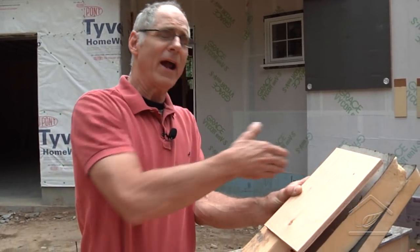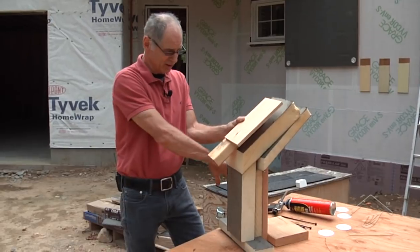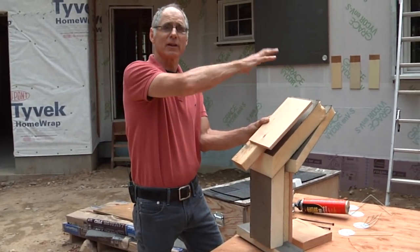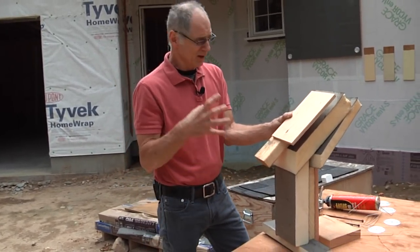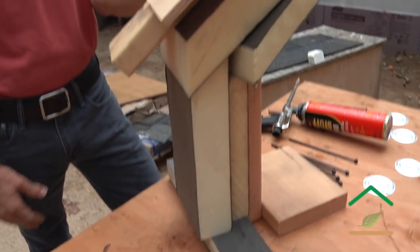We're exceeding R-40 on the exterior wall. The rafters are 2x10 and will be filled with cellulose, just like the joist bays will be filled. That same insulation we're putting on the walls goes right over the ceiling, making for a tremendous barrier to keep air out and heat in — and hopefully we'll manage this house with very little energy.